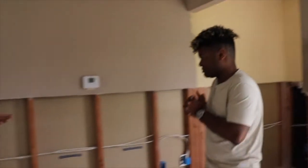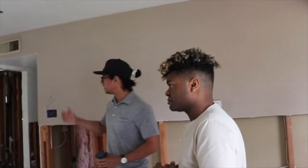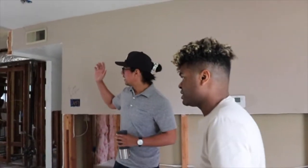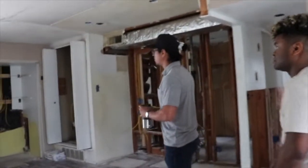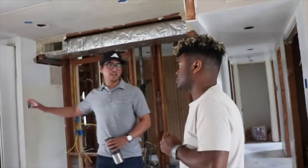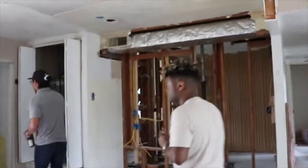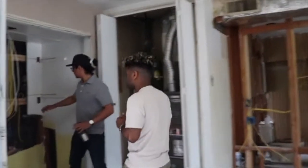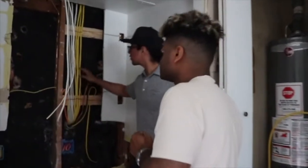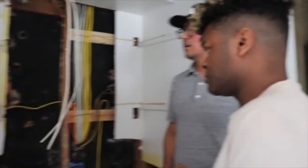Give me the rundown. As you know, the city asked us to bring in an electrician and inspect that everything was safe, basically up to code. For example, to begin with, the panel was in the laundry room, but code requires three feet of clearance on every side, and that clearly wasn't up to code. So that had to move, and once you move that, you have to put everything else up to code. This is all new wire — all the old wire is out of the house. Everything you see here is new: the boxes, the wire, everything. We're also making new holes for switches and things like that where they need to be per code.